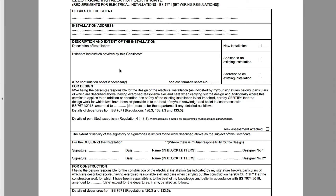When you do a board change, you're not required to test the full board at that point. What you need to do is, prior to starting the job, you should have already done a condition report, because that will then cover you for any alterations you make further down the line. It should highlight any defects within the installation so that you know it's fit for continued service.